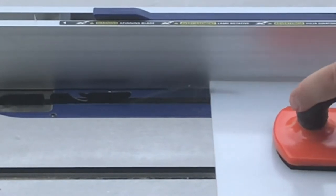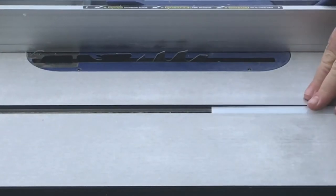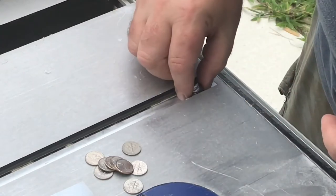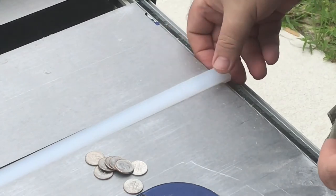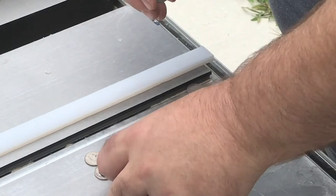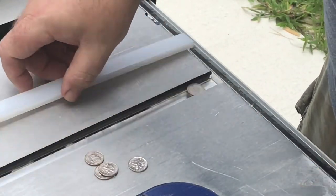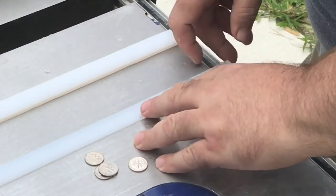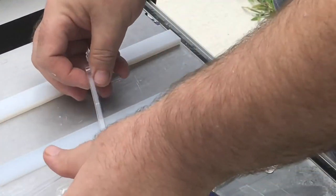With the cut dialed in so the cut piece fits in the miter gauge slot with no side-to-side movement, I can now cut the runners out of UHMW — ultra high molecular weight polyethylene. This material is low friction and will not expand or contract like wood. I'll put a link to this in the description. I used some dimes and washers to raise the runners just above the surface of the table. The runners track in the miter gauge slots without bottoming out, but are not long enough to span the whole table saw, so I'm using two runners lined up in each miter slot.